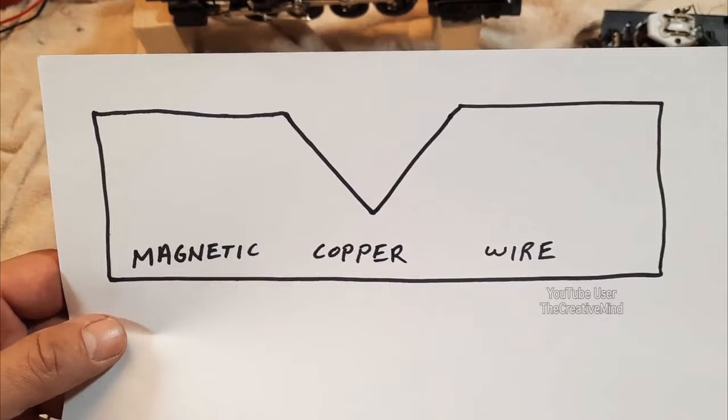So when I was reading 1.92 amps on my meter after two minutes, in a bad coil this area might read 1.5 amps, 1.2 amps — you could even read as low as 0.8 amps — and that would indicate that there is a problem with the magnetic wire and it would have to get replaced. Now if the cut or gouge in the wire was not as deep, you may not see that high of a drop in current. However, it is still an area of interest because if you are drawing more current than normal it could fault in time. Either way, if you use your digital multimeter to read continuity between the wire you would not even read these faults — you would only read continuity.